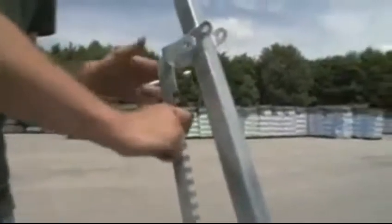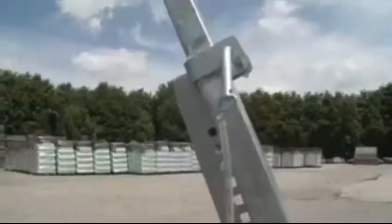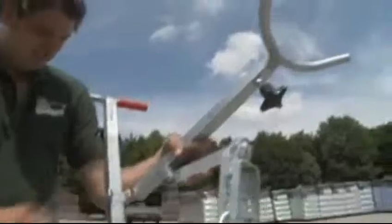In order to mount the trunk holder, first of all the top adjusting strip must be fixed to the basic device with 2 pins and the safety hooks. Then the trunk holder is mounted to the top end of the adjusting strip. The bottom part is mounted with pins and safety hooks at the desired angle position of the trunk holder.